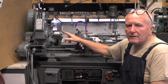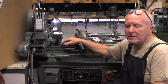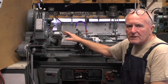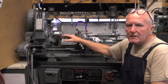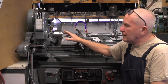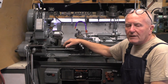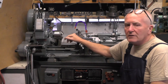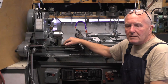Some people don't like these tri-lever lathes, but I find it a marvellous bit of kit. I think it's all to do with whether you get the mechanism set correctly. If it's not set correctly it's probably a bit haphazard, but once it's set right it's marvellous — you don't have to mess about lifting covers up to change belts and pulleys over; you just hit the levers and it's more or less an instantaneous change from one speed to the next.